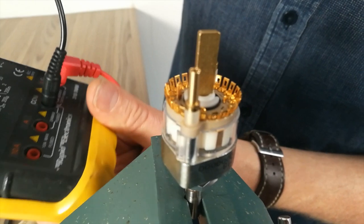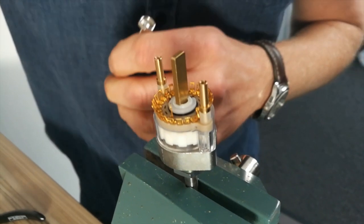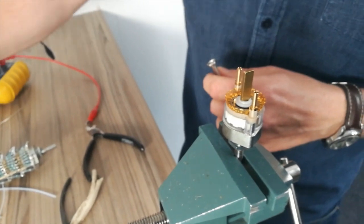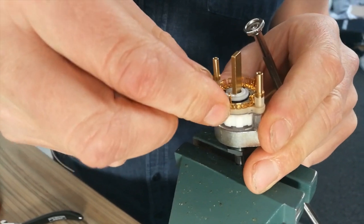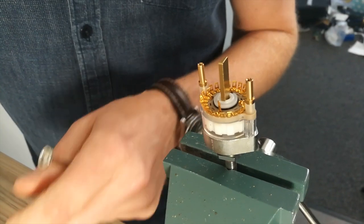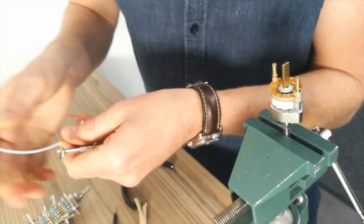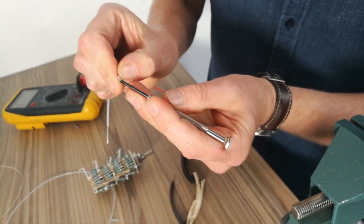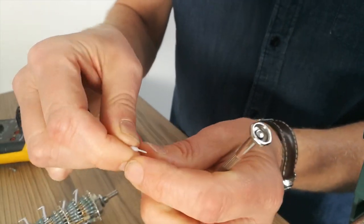three. So the reason you have to take these things apart is because you can't access these solder points when it's like this. You can't get to any of there to the output to solder. So just grab a bit of 1mm silver wire, pure silver HGC, cut it to about there, solder there, and then cover up the end, the PTFE. So just so it doesn't move, what I generally do, once it's soldered, I'll bend it over there, so it doesn't move up and down.